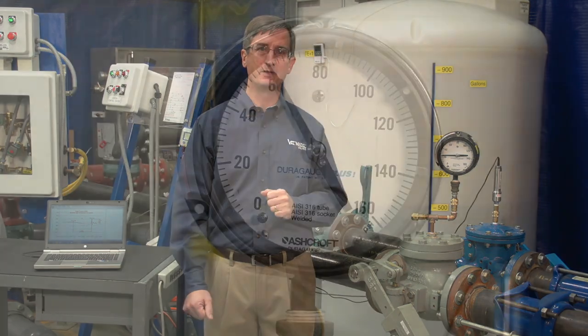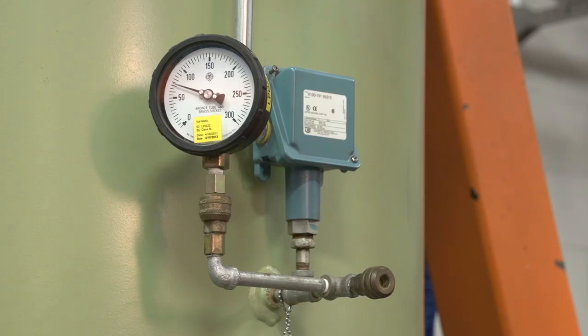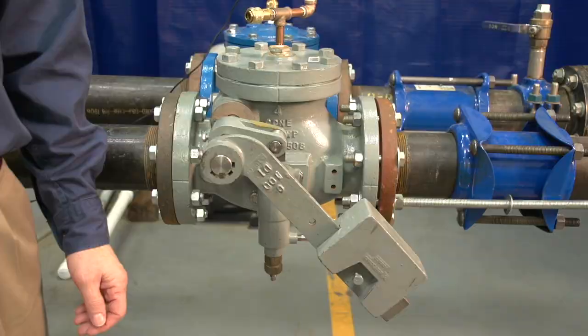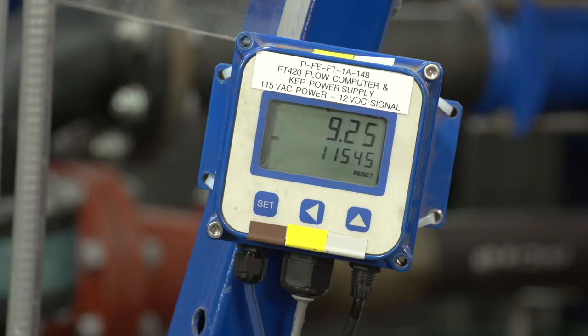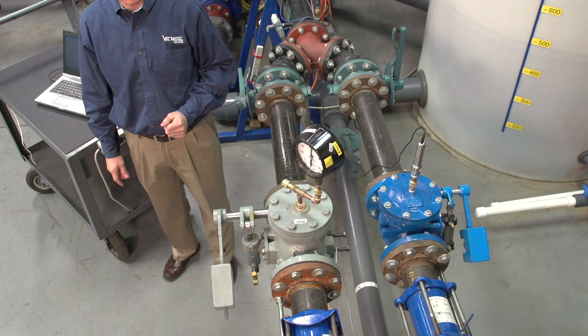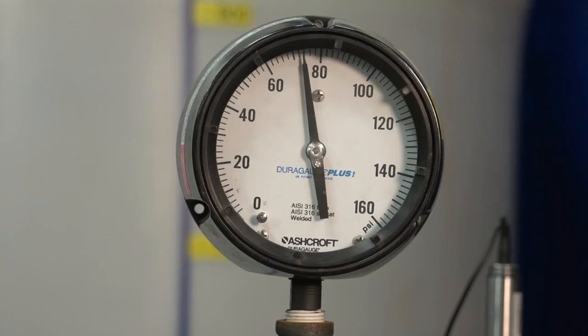To demonstrate the effect, we will first pump water through the conventional check valve and into the hydropneumatic tank. When the pressure reaches 80 psi, a pressure switch on the tank will trip the pump. Then in a fraction of a second, the air in the tank will stop the flow and reverse it rapidly back toward the check valve. So let's start the pumps. You can see the valve opening. The flow is about 9 feet per second and the pressure is building. You can see the pressure reached 80 psi, and the pressure switch automatically tripped the pump and slammed the valve closed.